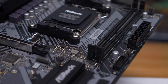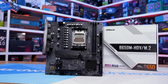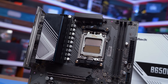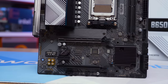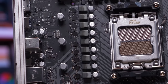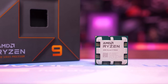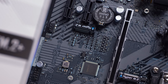I was very keen to see what the A620M-HDV/M.2 Plus could do, especially after having been so impressed with the ASRock B650M-HDV/M.2 just weeks earlier. The B650 version of the HDV is an excellent value motherboard, currently costs just $120 US, and amazingly has no issues powering the Ryzen 9 7950X with its eight 50-amp power stages. The question is: could the same VRM but with two fewer 50-amp power stages - so half a dozen in total - be enough to tackle the 7950X? Now you might say why does it matter, no one is going to pair a 16-core CPU with a cheap A620 board.